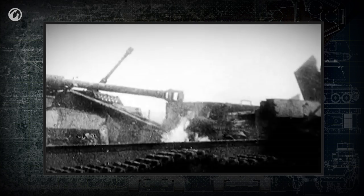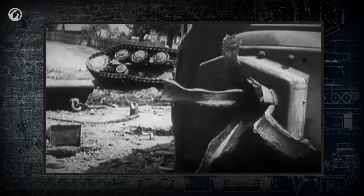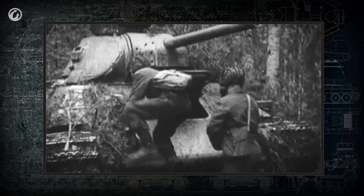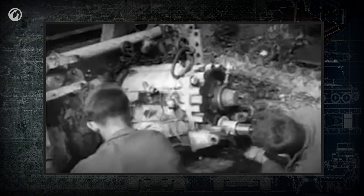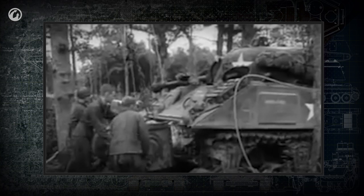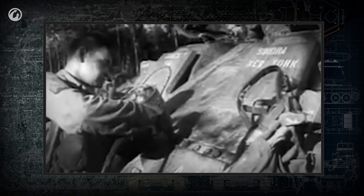The same fate threatens a tank with a hull that is not strong enough to survive numerous other battlefield effects — landmine explosions, non-penetrating hits from anti-tank rounds, and near misses by aerial bombs and artillery. When designing a hull, optimal placement of crew hatches and mechanical access points in the armor is very important. Any hole through the hull — even one covered with an armor plate — weakened the integrity of the tank, so there shouldn't be too many. On the other hand, ease of access to the engine must be considered, and the ability of the crew to bail out quickly from a burning tank is crucial.